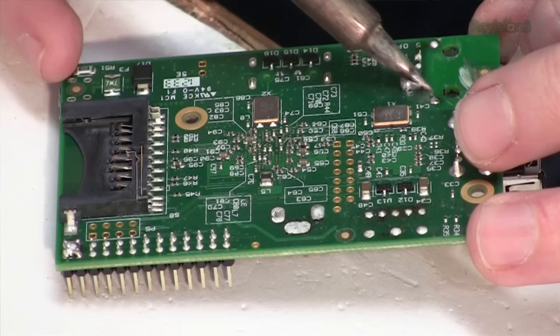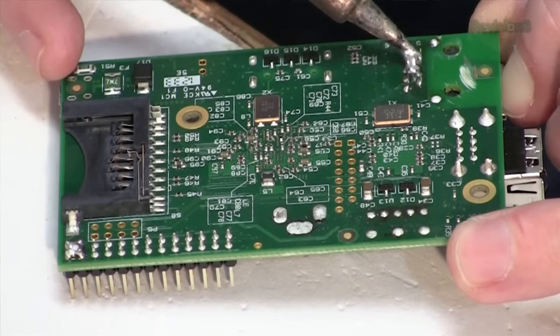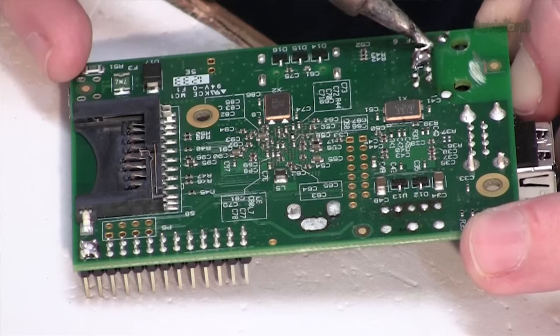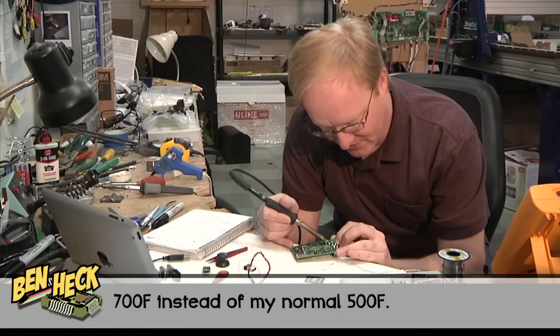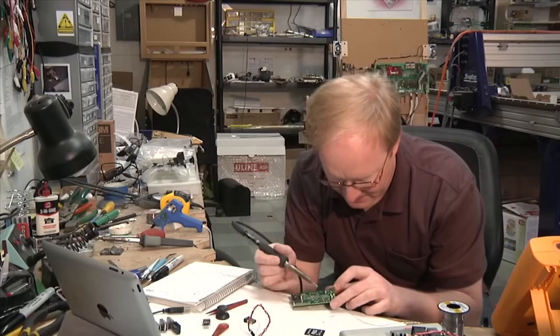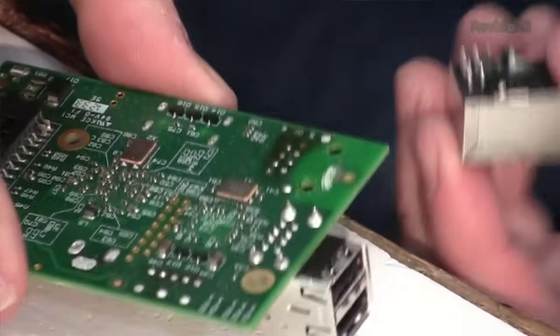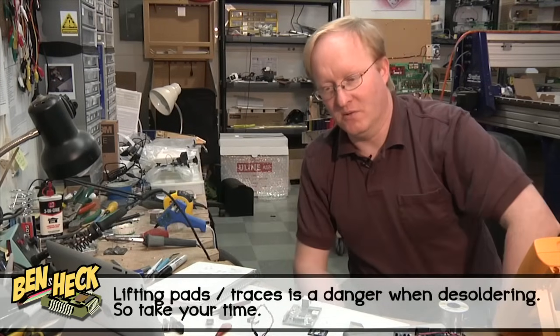I'm going to remove as many parts as I can from the Raspberry Pi, like this Ethernet adapter which I never use. It's through-hole and it's lead-free, so it's a little hard to remove — I can't really use a normal desoldering iron. What I'm doing is using my iron set to a high temperature with a big blob of solder, going back and forth between the points. Each time I do, I'm kind of pulling it loose with my other finger, so slowly it gets rocked away. Going step by step, it will eventually come loose. Got it.